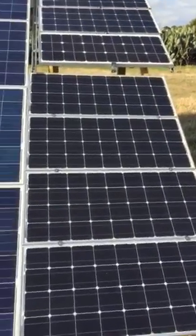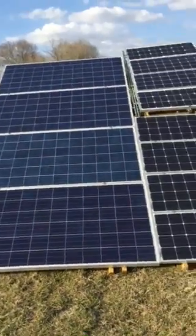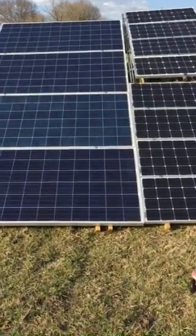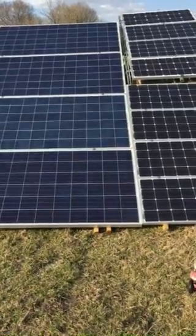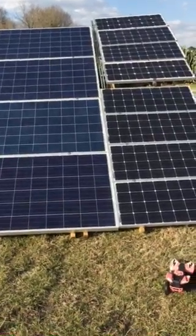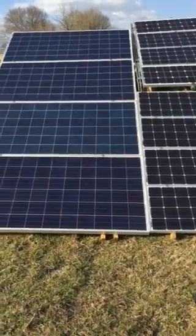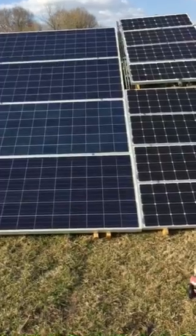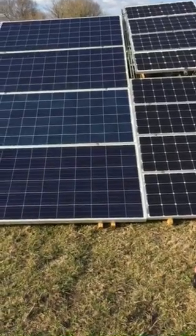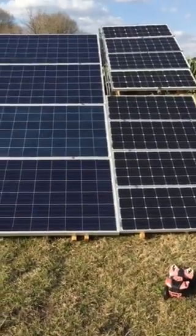They're all rated at the same voltage. The blue panels are rated a little bit higher. I found that with my MPPT charge controller, if I reset it every 90 minutes I'm able to get maximum power point. I used to have two charge controllers running the two different types — polycrystalline and monocrystalline — but when I ran my tests, the output difference was negligible. With a full two kilowatts running through the system, I'm probably losing maybe 60 to 70 watts.